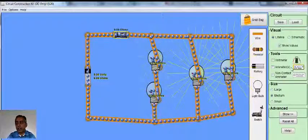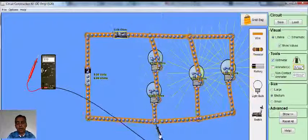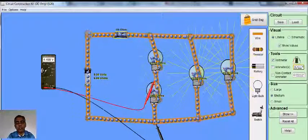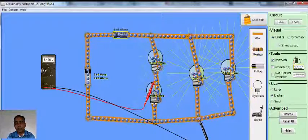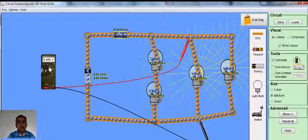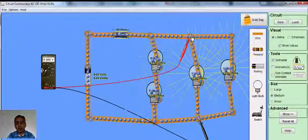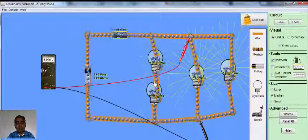So what could be the reason? Let's find out. Let's take a voltmeter and connect one end of the probe over here, another end of the probe right there. It looks like we have around 4.5 volts across each light bulb that is connected in series. Now let's move the black probe right there and the red probe right there. We see that the voltage across each light bulb connected in parallel is 9 volts, which means the bulbs connected in parallel have 9 volts impressed across them, while the bulbs connected in series have only 4.5 volts — half the voltage.